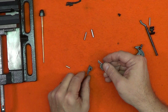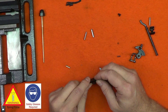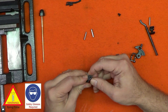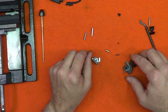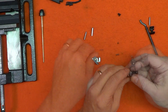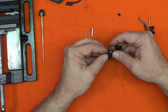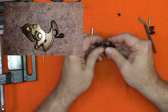The first step in frame assembly is to build a sub-assembly of the sear, drag spring, spring support, and a slave pin. Of the two springs, the drag spring is the long one. Place the drag spring into the sear and practice lining up the spring support to compress the drag spring into the sear. Note there is a significant probability you will launch the drag spring across the room at least once during this process, so a careful study of how the parts line up will be helpful. Assemble the parts with the slave pin. Then assemble the hammer and disconnector using a slave pin. Place the disconnector spring — the short one — into the spring support, then use the crossbar on the disconnector to compress the disconnector spring, and latch the sear into one of the lugs on the bottom of the hammer. Smooth up the sides of the assembly so it will drop easily into the frame.